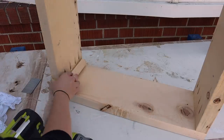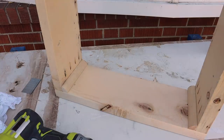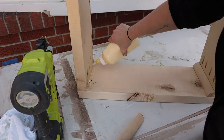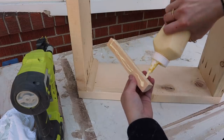Here's the concern with a tall table like this: the longer the legs, the more you'll see them bow inwards, which isn't what we want and doesn't make it very secure. To make sure the legs stay straight and there's no bowing, I'm adding another piece of wood into the corners to act as a brace. You can also create 90 degree triangle braces on the inside, or use L brackets — anything that will reinforce that angle.